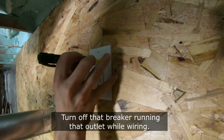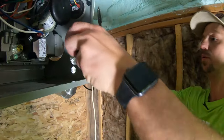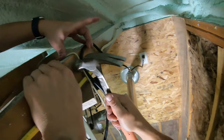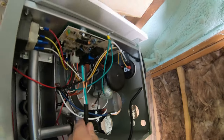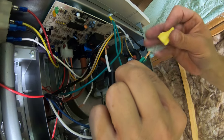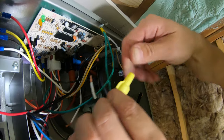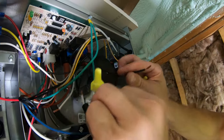We're going to make sure we're not on a hot circuit before handling it. This is on a separate one — the top outlet is safe so we'll go with that, leaving the bottom one exposed for anything else we might want. We run the power through and staple it up above so it stays out of the way of all the ventilation. Green to green — twist them up as good as you can, wire nut as tight as you can, make it snug, and make sure neither wire can be pulled out. Repeat the process. Very simple wiring.